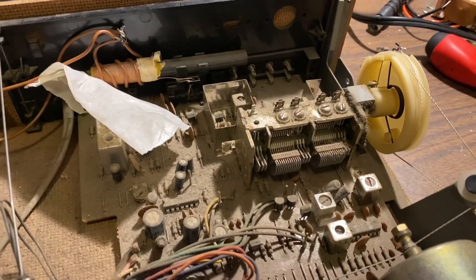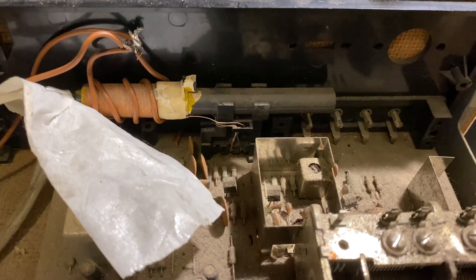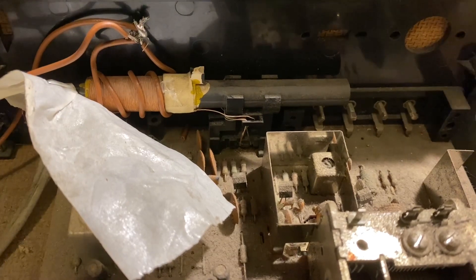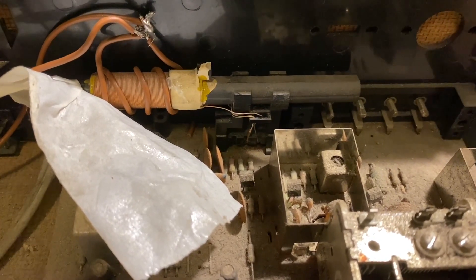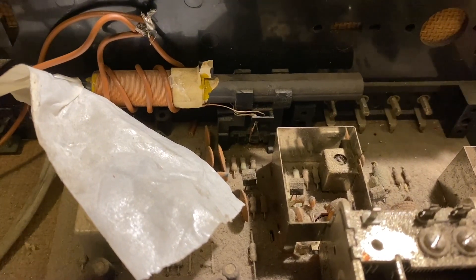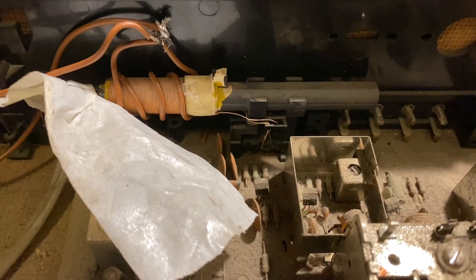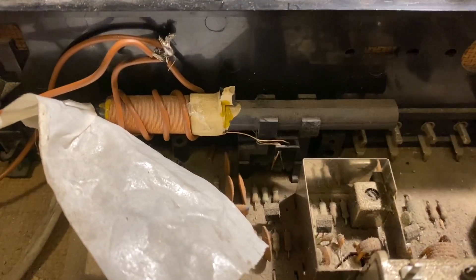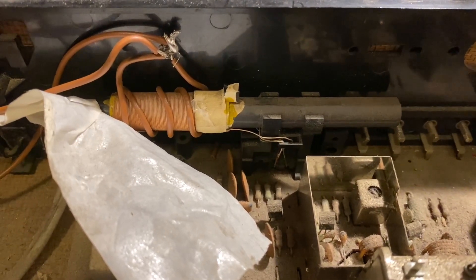To convert one of these to pick up shortwave is really pretty easy. Look for the ferrite rod with very fine copper wire around the end of it — that's the AM antenna coil, and you'll find it is covered with wax. Get some insulated wire and make a coil. Cut a piece of wire about six to seven inches long and wrap that coil around the ferrite antenna where the copper is, just like that. Then bring the two ends together and solder them — that's going to be your external antenna connection.